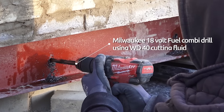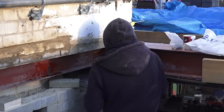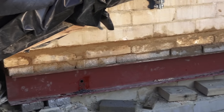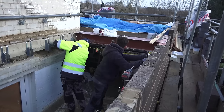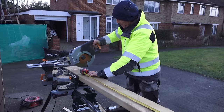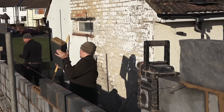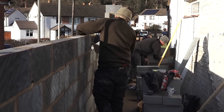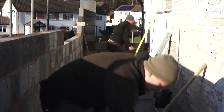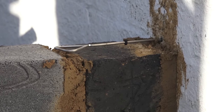Here we're just drilling this steel beam because I need to get the bits of timber bolted up onto that beam for the jiffy hangers. We've got the double timber in there, we've bolted through, just about fitting the nuts on the other side. Just cut a bit more off those joists because they're now not sitting in the wall — they're going to sit on the hangers — so they've got to be shortened by that much. And there's Alex getting the block work up because now we've put the joists in they've got a good platform to work on the inside.